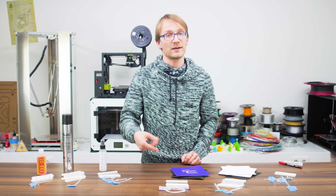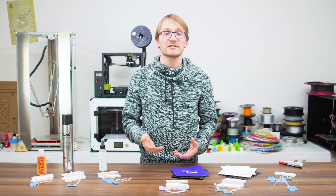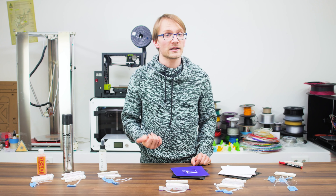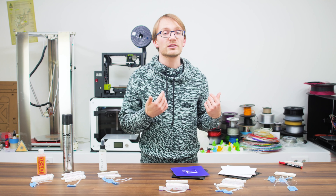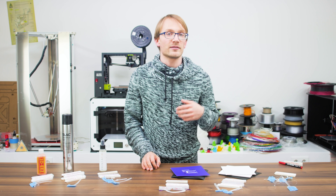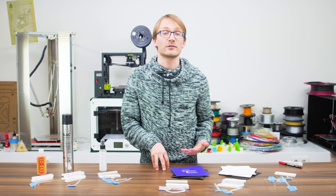And for each material, I ran a print with and without a heated bed, which for PLA and PET is still something you might want to do, especially on low-end printers that are lacking a heated bed. But honestly, ABS onto a cold bed was just something I wanted to know if it was even possible in the slightest bit. The temperatures for the heated bed when it was used were 60 for PLA, 70 for T-Glase, and 105 degrees for ABS. The ambient temperature around and inside the printer was at a controlled 18 degrees for each test, and that was also the temperature I had the heated bed cool down to when I ran a cold test. The printer I used was my usual Mendel 90 experimentation platform, which is a total mess but works extremely consistently, probably due to the fact that I know every nook and cranny of its printable heart.